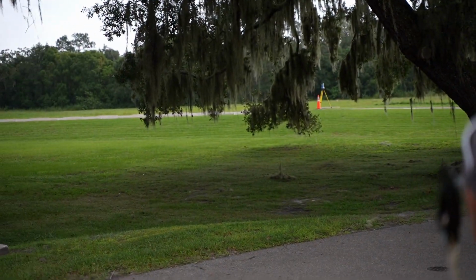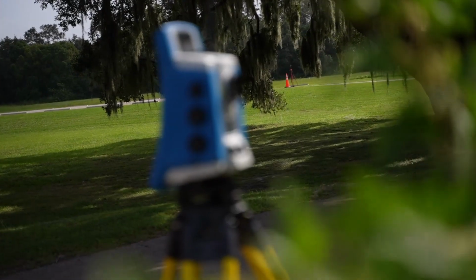When setting traverse hubs, it's handy having 2 people, so you can have one person stand on the setup point and the other can thread the needle, if necessary, to set hubs when the line of sight may be a narrow gap between obstructions. When I'm working solo, I will usually level my instrument over the setup point and then demarcate my backsight, foresight, and common points, all while the instrument is in place and set up, so that when I'm scribing or hammering in a control point, I can make sure I can see the total station, and I usually just set the hubs as I go.